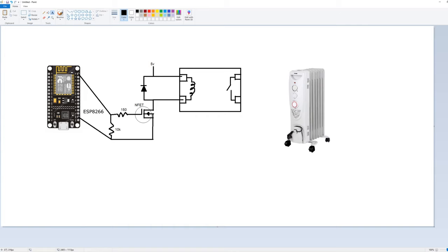The microcontroller can't really put out much current and it only operates at 3.3 volts, but the relay is going to draw some power and it operates at 5 volts. So the NFET is behaving like a switch, which is going to allow a 5 volt power source to drive the relay, which is then going to turn on power to the heater. The rest of this is just sort of circuitry for protection, but I'm going to put a link in the description if you want to learn more about what's going on here.